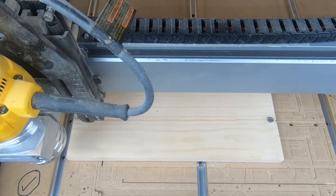Now we have the workpiece mounted to the Shapeoko 3XL CNC router deck and I have a quarter inch end mill bit installed. Already zeroed out on the XYZs so the computer knows exactly how the piece of wood is mounted on it. And now we're ready for the first cut, which is a dado. This is where the lever point on the boot jack that will go down to the floor will be attached to. We'll go ahead and cut that — here we go.